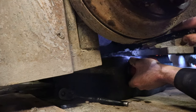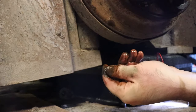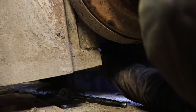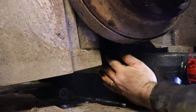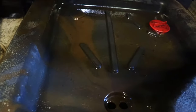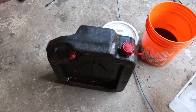This pan can't keep up with that much fluid — it's so thin. There's no magnet on the plug, so you can't really pick anything up on it. It's hard to be clean working on a forklift. It looks like we have more flushing to do — there's quite a stain on here. I think I'm going to pour some diesel straight through and then fill it up and dump it out again. I'll empty the drain pan into this pail and use it for bulk cleaning of these hubs.